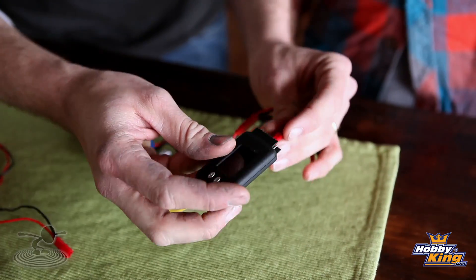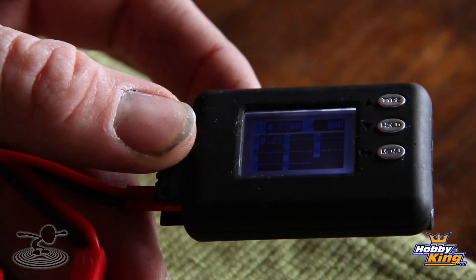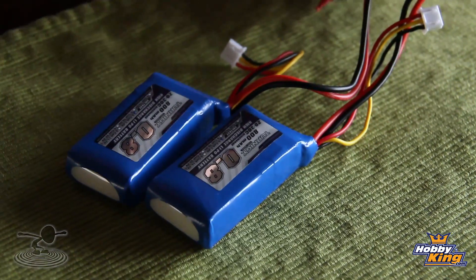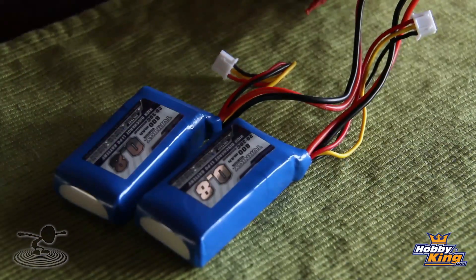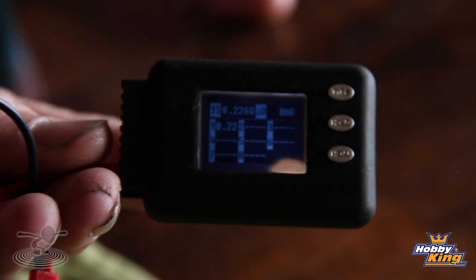Let's go ahead and plug this in and get a reading. As you can see here, we have 8.22 volts. We do not have 14-plus volts — only 8.22. But what we do now have is two 800 milliamp battery packs, so we now have 1,600 milliamps in capacity. A parallel battery pack will allow all the capacity to go through, but it will not increase your voltage. Very simple to solder too — all you do is keep your red leads and your black leads soldered together and you're good to go.